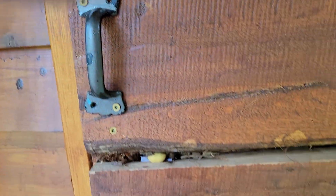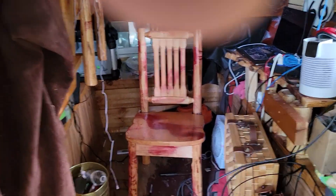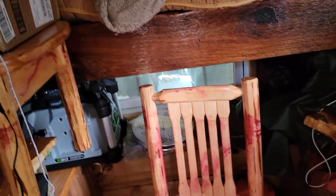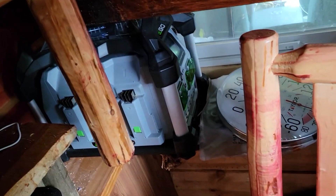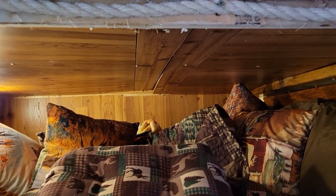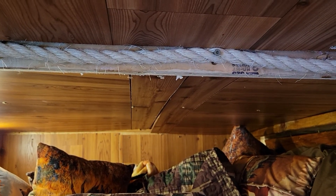Then I have to cut the zigzags. Granted it's dirty and messy. I've got some of these type of baskets that I'm gonna put up under the floor, under the overhang, and be able to store everything in them so it doesn't roll around while I drive. I finally figured out the paneling back there — I'm gonna cut a two-by-two in half, insert it in there, nail and screw it in the back, and then screw these pieces into it.